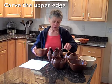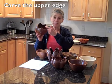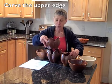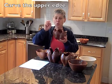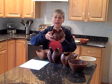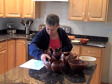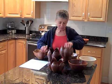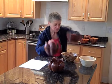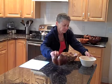But for deeper carving, I used, this is the round inflatable sander, I just carved it down. And where you're going to get smaller, you can go to littler sanders, your little 1/4 inch Dremel, go down here, a carbide burr, and then your bowl starts looking as though it's carved and not scrolled. And the last suggestion I'm going to give you, let me clear the decks here so you can see exactly what I'm going to do.